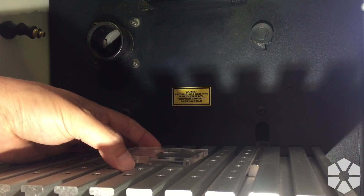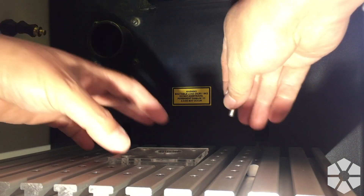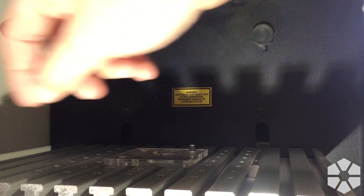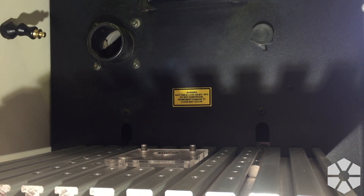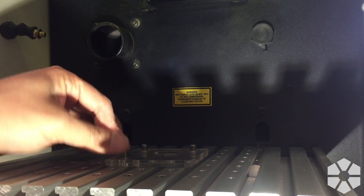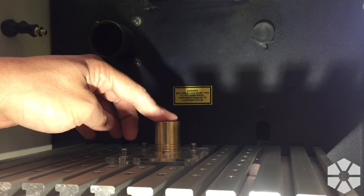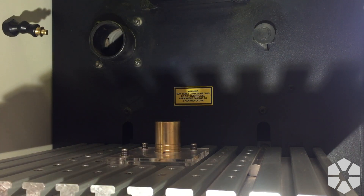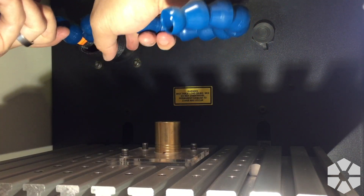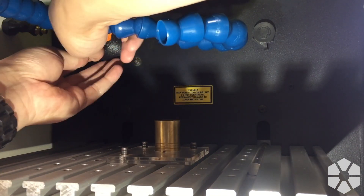This is a little fixture we use to engrave pin screws — just some laser-cut acrylic pieces held in place with dowel pins. The top of this table has a grid machined into it that we did in-house. I just did a casual fit-up, held it up in the machine, and I think this is going to need to be a little longer. It's probably a tighter fit than I'd have wanted, but maybe that'll be good. We need to keep the lock-line out of the way of the robot.